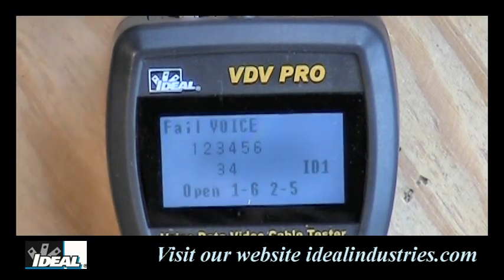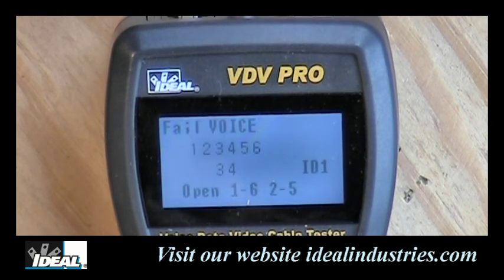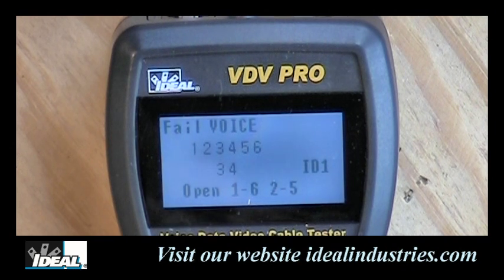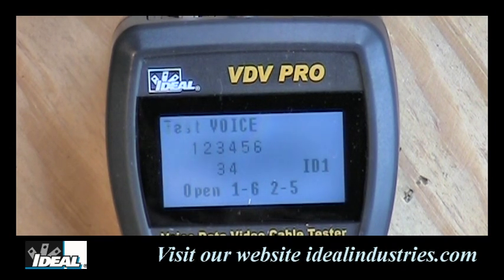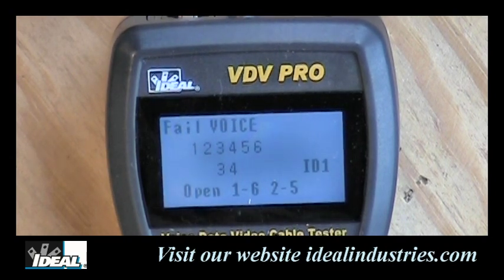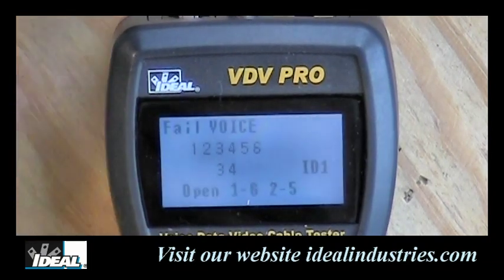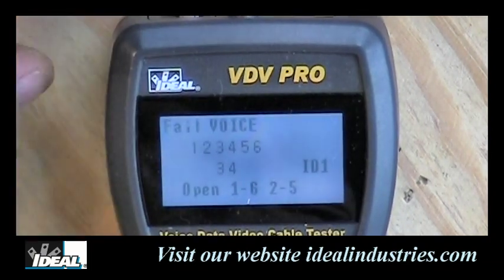However, when you buy telephone wire, you can buy it with just 2 wires in it, like this cable has in it, and it's for exactly 1 phone line. If you get 4 lights lit up, indicating the cable's got 4 wires in it, it's for 2 phone lines, and so 2 and 5 would be lit up there. And then if there were 6 pins in the cabling, it would light up all 6 of them here. So even though that says fail, if I've just got an extension cord for a single line phone, this may actually indicate that that's good.